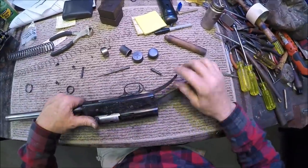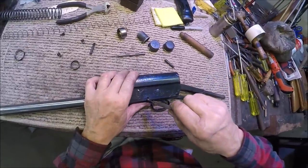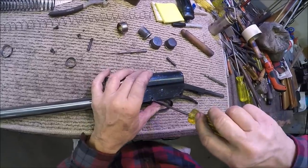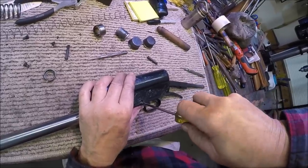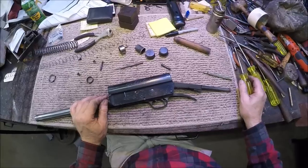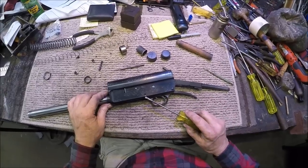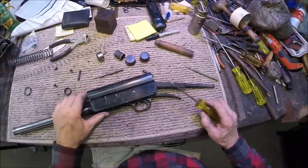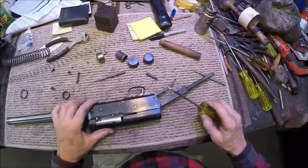Okay. Yep, comes through just about right there. All right, here's our front trigger plate screw. And this has a lock screw on it. So this, I take it back, that's not even a screw, it's a pin. It just pushes in, like so. Now, we're going to go ahead and assemble this gun, but I'm going to send this front trigger plate screw back to my nitrider, my guy doing the niter bluing. See the screws here, they've been nicely niter blued. They're kind of that purplish iridescent blue color.